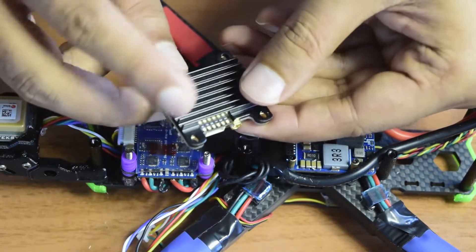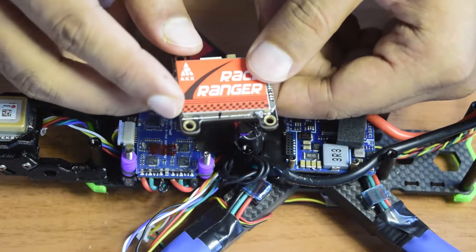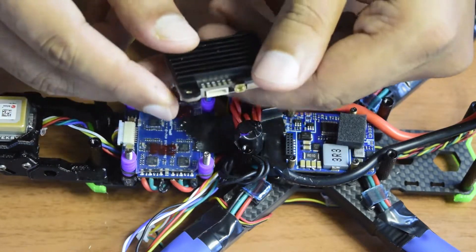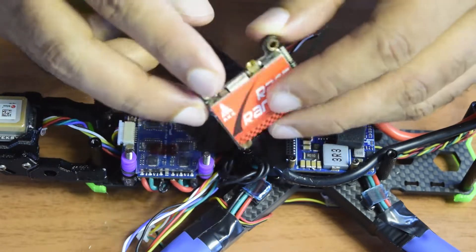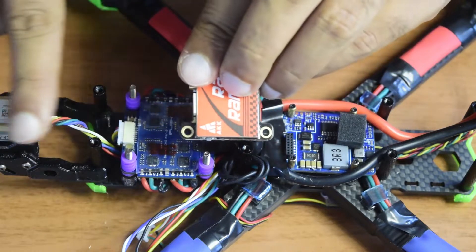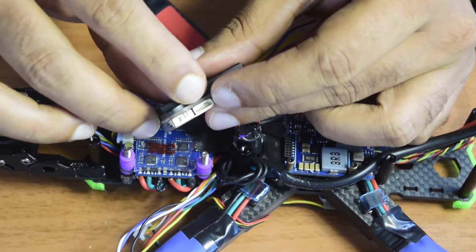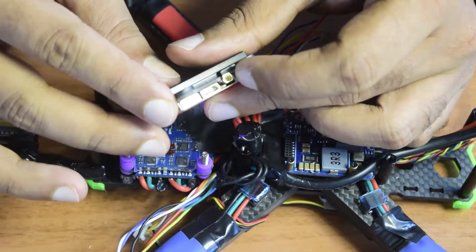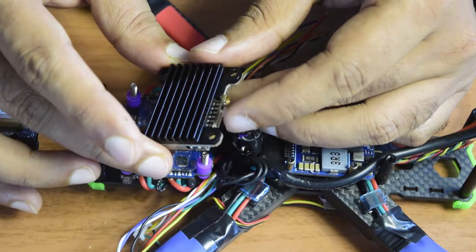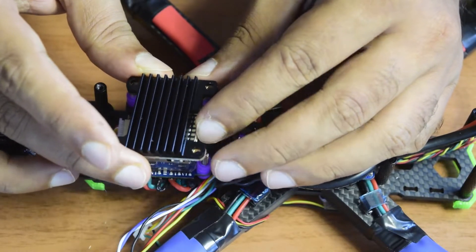The video transmitter is well built — it's covered with metal on top to prevent interference from the microcontroller, ESC, or motor control unit. On the bottom side it has a heat sink to keep it cool. On top you have an antenna holder, and it comes with an antenna extender which I'll place on the back side of the drone frame. There's also a six-pin micro JST jumper connection with two input pins for voltage powered from the microcontroller, and two 5V output pins to power the external DVR.